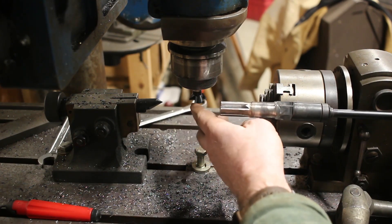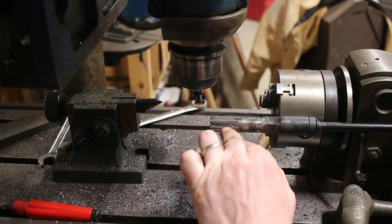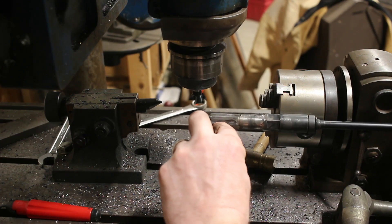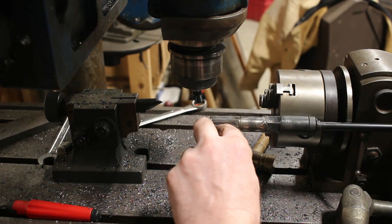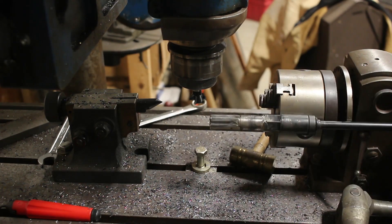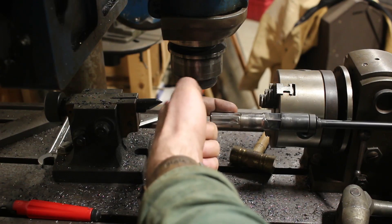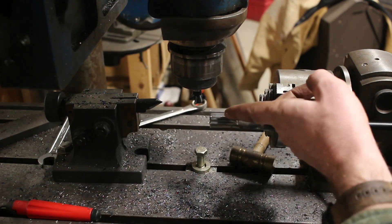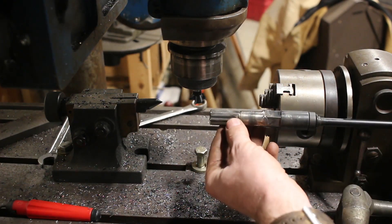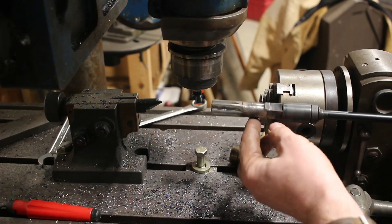I forgot to hit record while I was cutting these, but basically I just used my 60-degree dovetail cutter and went in and cut each side. I cut the backside first, just down a little way, because I knew how thick these needed to be based on the height. I didn't know how far to go in, and it would be a lot of math to calculate that, so the quick and dirty way was to cut the backside slot, which showed up as a reference face, and then I moved in just until I barely touched and made a pass. I went around all six sides and got it cut, then welded it onto my other drawbar.